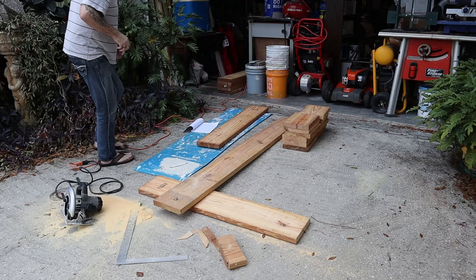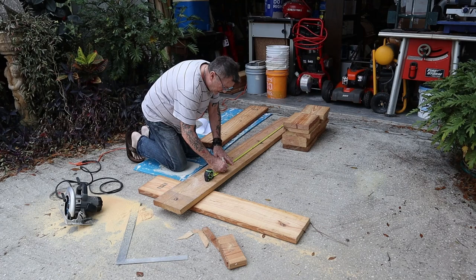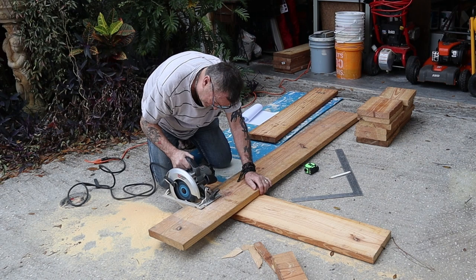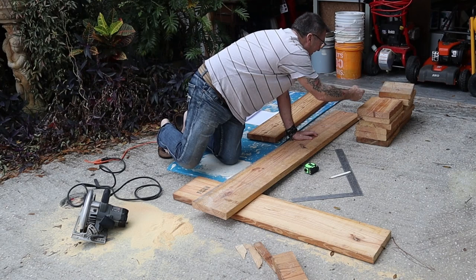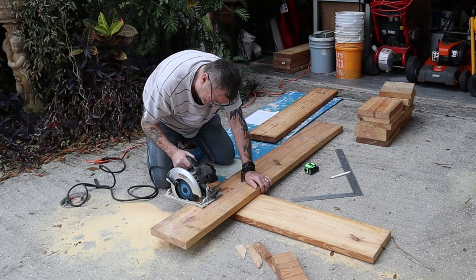Here is the master woodcutter outside the garage. This is the material — two-by-tens that I had quite a pile of saved, so this project is costing very little. Paint I keep and save. With a brand new carbide blade on this saw, these big two-by-tens cut just like butter. I need about 36 of those at 12 inches, then two different shelf sizes, and a couple odd ones like where the garbage goes.